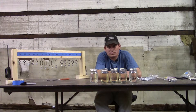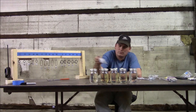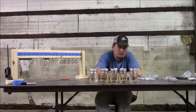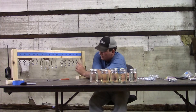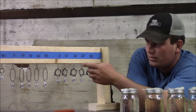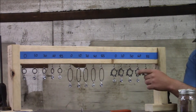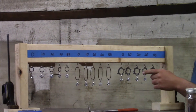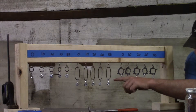We needed to get some more weights for the test since the previous setup didn't do the trick. I bought some more hooks and some bigger washers to weight these. There is still not enough weight to show a real difference — none of them are brittle. The O-rings on the left show nothing. The rings in the middle: the E0 is not very stretched, and then E10 is stretched some. As you increase ethanol, it stretches less. E85 is similar to E0.